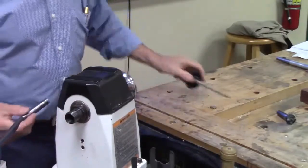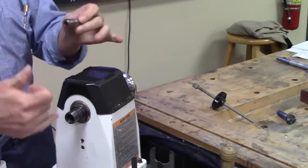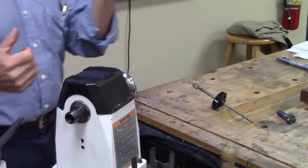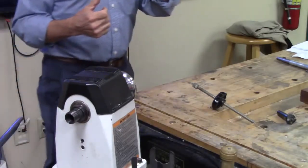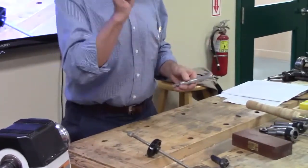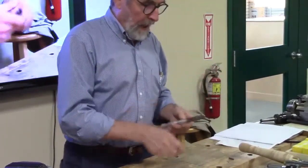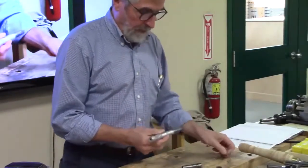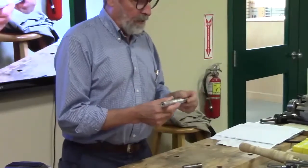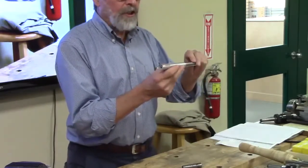Well, you don't have any extra pieces. So you've got one collet on the taper, so you should get the best concentricity with this one. The problem with these is the largest size you have is 1/2 inch. I used to use them a lot more until I got into ER collets, which we're going to talk about. But you're kind of limited in the range that you can use.